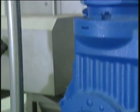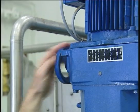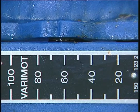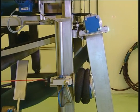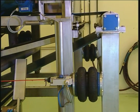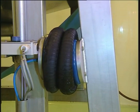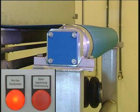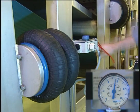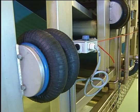The quantity of mash to be pressed is regulated via an adjustable gearbox or a frequency inverter. A pneumatic manifold system is utilized for belt tensioning. For the security of the operating personnel, there are protection devices, and the whole system can be switched off via an emergency pull cable switch.